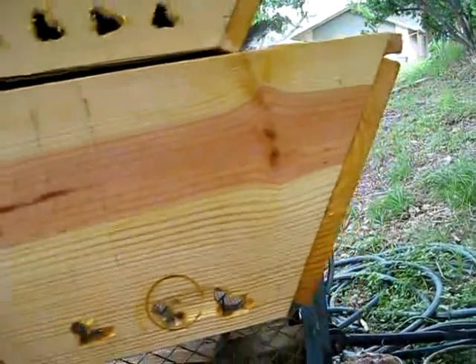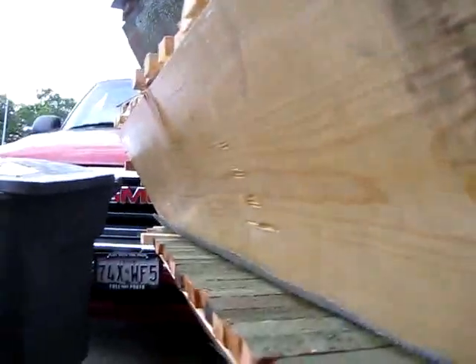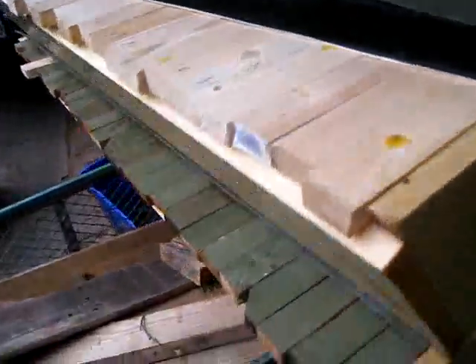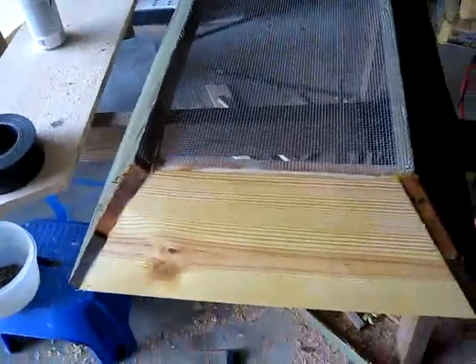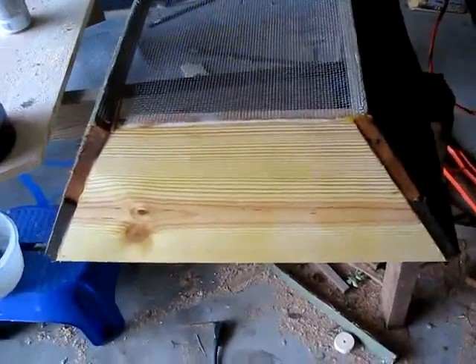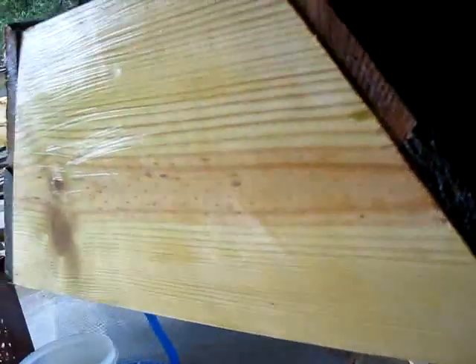It didn't take even a quart to paint four of these — really only painted four ends and two sides. You can see how it's still wet and shiny. This is just for weatherproofing; it's not about aesthetics. It's going to be globby. It went on fast and it's going to dry in a few days. It's still wet to the touch — I'm going to give it probably a week to cure. Boiled linseed oil is supposed to dry within 24 to 48 hours, but raw linseed oil apparently takes weeks. I'm pleased with how it applied; we'll see how well it weatherproofs.